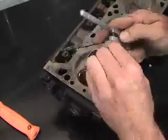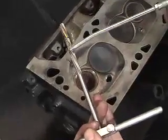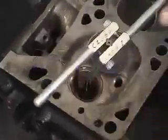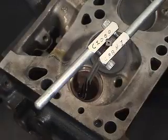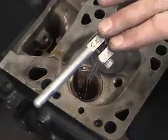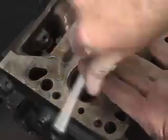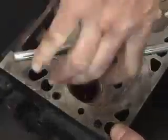Remember, this guide is an integral guide. We're going to use the appropriate cutting oil to lubricate it and drop the reamer directly into the hole. It should not go through the hole at this point because we're five thou over the manufacturer's major diameter of 312 — we're using a 317 reamer. Using your hand, apply light pressure, turn in one direction, and start to remove the material, cutting directly through the integral guide until we manage to get the tool all the way through.